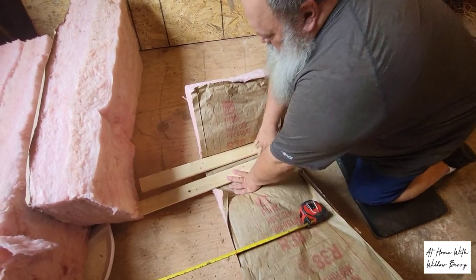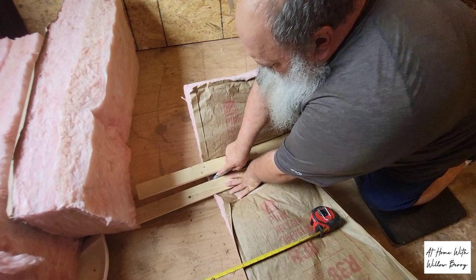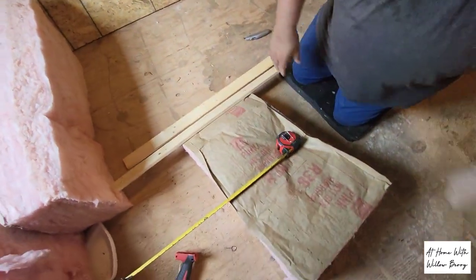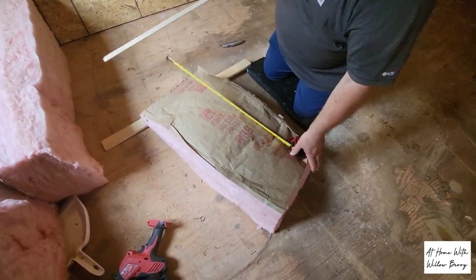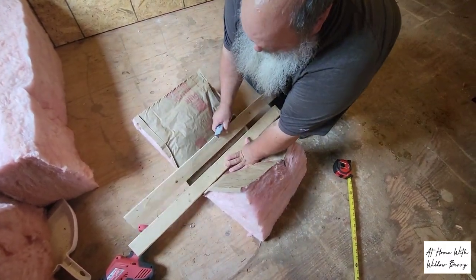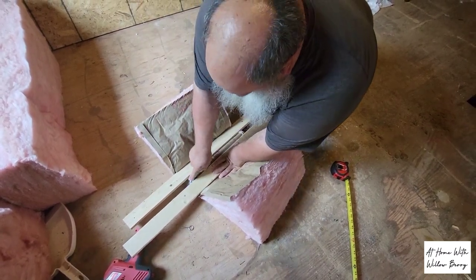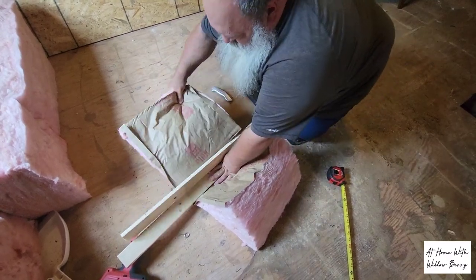I would love to stay outside all day and play with Milo and the pups, but Tim is already hard at work, so it's time to head back inside and give him a hand. Before we can lay the subfloor, we need to add more insulation between the floor joists. A lot of the old insulation has fallen down to the ground. We will eventually have to go under the house and secure the insulation with a garden mesh type of material to prevent it from falling through again. But for right now, we are just stapling the insulation in place.